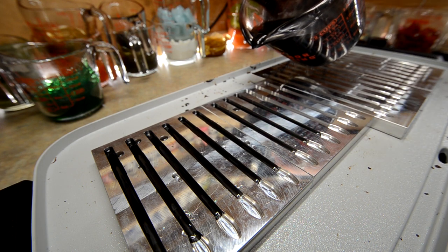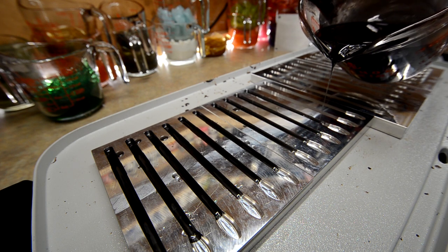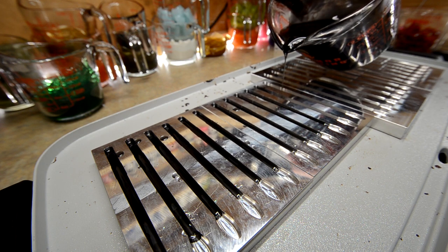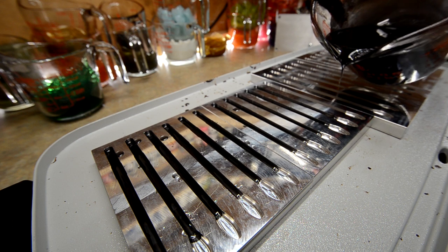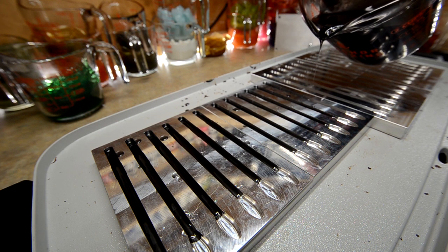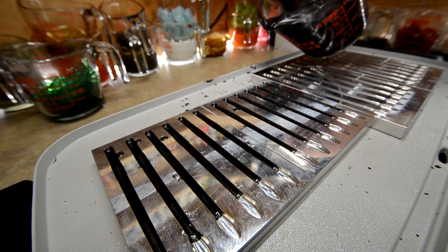Again, we're gonna get these in here. We're gonna heat this up a little bit, maybe more than what I've got now. I've just got the griddle on warm, and they probably will bleed into the tails, but that is okay because I will go through and cut them out and let these cool down in between the layers. So it's a little bit of a lengthy process, and again, I'm getting some drips here and there, not a big deal. We'll go back through and clean it up after. But the important part is I get enough plastic in there so that it levels out.